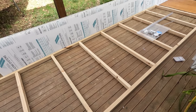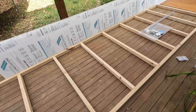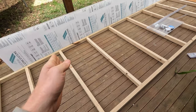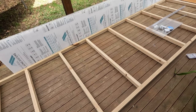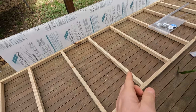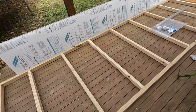Now, with our 6mm twin wall, you can have the rafters up to 600 apart, which means you can either get 600mm wide sheets to be joined on each rafter, or you can get 1200mm wide sheets to be joined every second rafter, which means the middle rafter in the middle of the sheet, you'll just be putting screws through the sheet rather than a joiner.